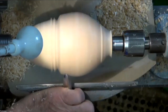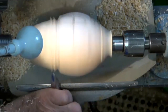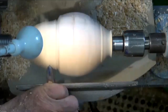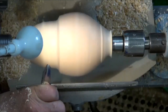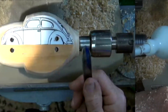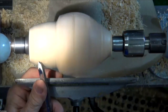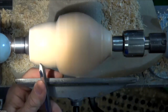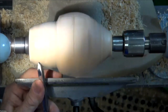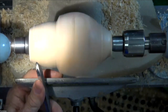The most important thing here is I need to follow that curve downwards, so I'm going to drop the bonnet a fraction. I'm going uphill now a little. I'm just coming off the bonnet and I need to come down a little bit more, so I'm rubbing the heel. You'll notice the tool is already turned, and if nothing's happening you just keep rotating the tool slightly and eventually it starts to cut.